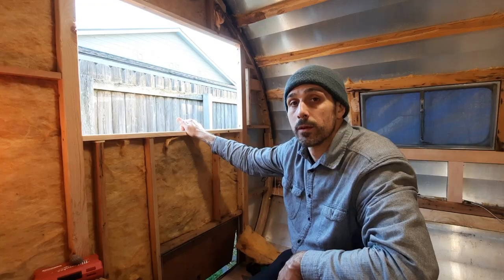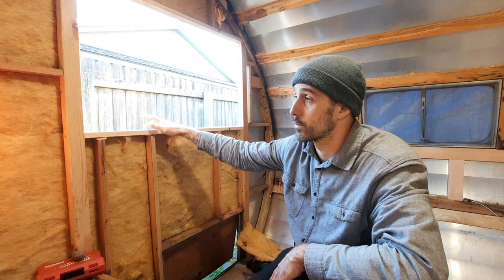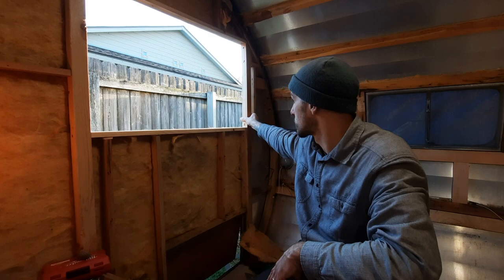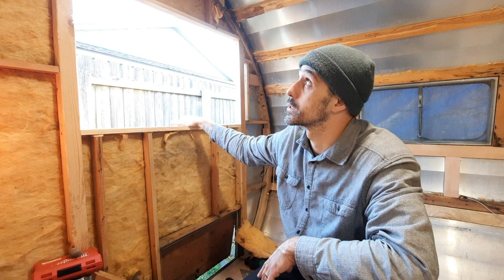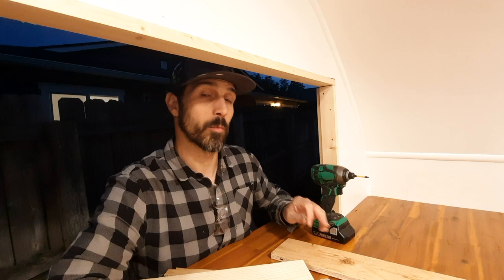I just finished framing out the service window. Basically what I did after cutting out the size I wanted was put new wood supports all around. I beefed up the sides of the window using some two-by-ones — about an inch and a half by two inches — just to give it better support for the hinges, and then a new top plate over the window as well. It turned out really nice. Today we are framing in our service window pretty much the same way we did it on our first trailer. We already made a video for installing a service window on our previous trailer, so check that out for a more detailed explanation.